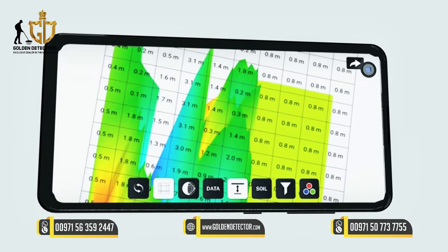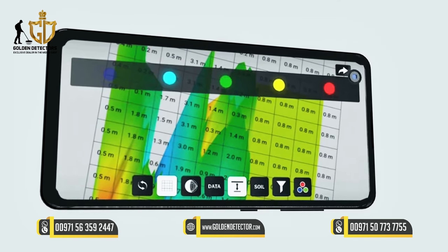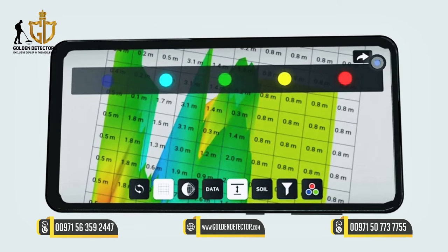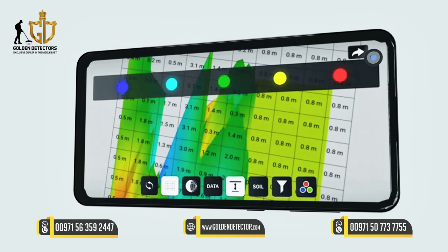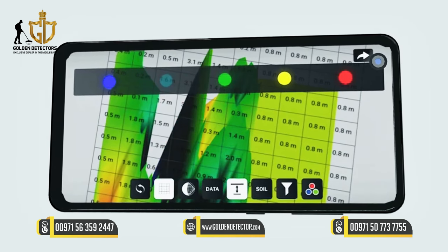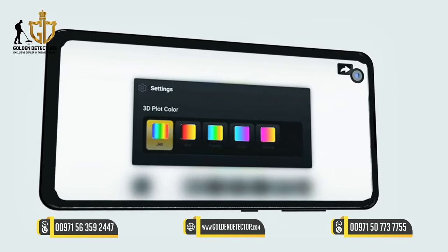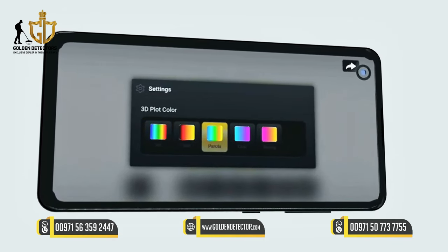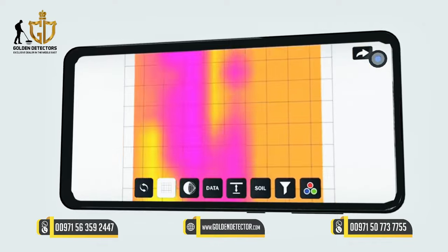7. Color filter. From this option, we can hide or show any color of the 3D drawing. Red indicates the presence of metal. Blue indicates the presence of voids or spaces. Green, natural soil. Yellow indicates the areas surrounding the metal. As for the light blue, it indicates the areas surrounding the voids. 8. Color gradients. From this option, we can customize the colors of the drawing to the color gradients that suit us. This option helps us filter certain colors from the 3D graph so the drawing is more visible to the user.